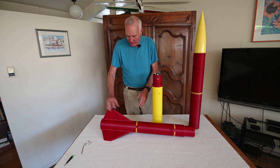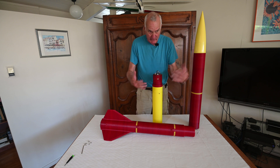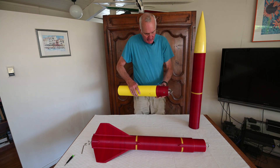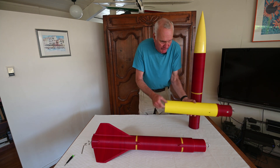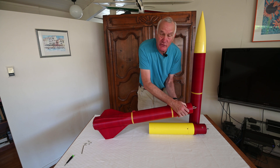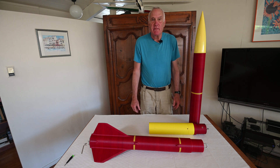The smaller rockets actually have 1010 rail lugs. This is the section that contains the drogue chute — it normally mates onto the tail section here. And this is the electronics bay. All of the attachment points that have to detach have holes, which you can see here — these are all printed into the rocket. The holes that interface with fasteners have actual metal inserts.